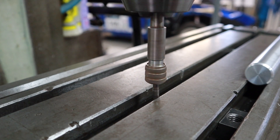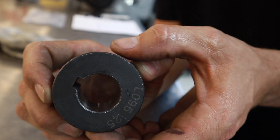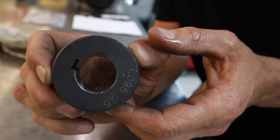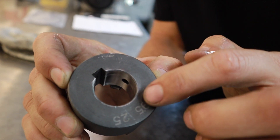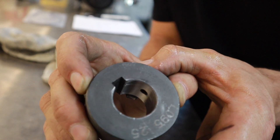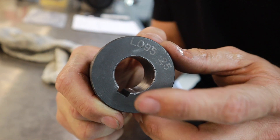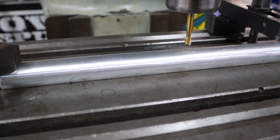Then you wobble over to the other edge — 5.59 millimeters. So zero is perfectly in the center. What we've got here is a little hub adapter. It's a 25 millimeter shaft and hole size, but the hole was a little bit tight on the shaft, so we've just opened that up a little bit with a linisher. Now we're going to cut the keyway into the shaft.